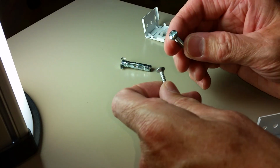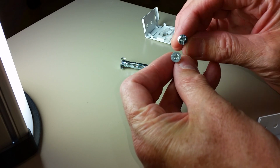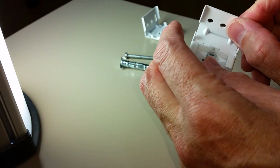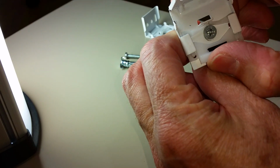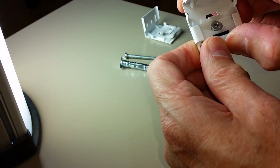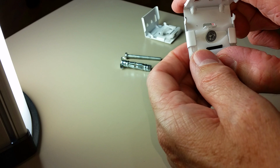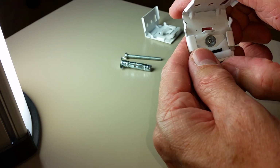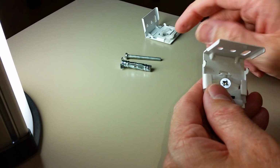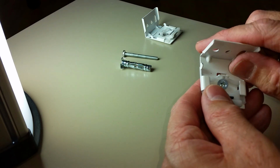Just one point to point out: these heads are about the same size. In fact, my bolt, the head is slightly smaller, which is advantageous. You'll see when this goes in here, and then the mechanism moves, the bolt or the head can get in the way of it moving up. Okay, so that's point number one, and I think that actually, even with the screws you've supplied, it's too big. So the ones I'm using are actually smaller. I've actually filed them down. So that's point number one.